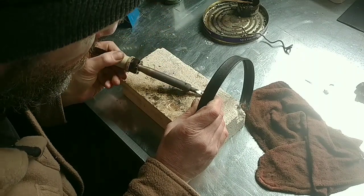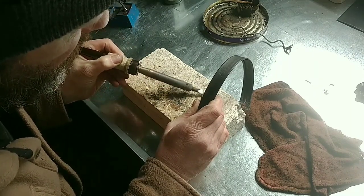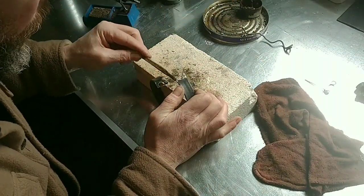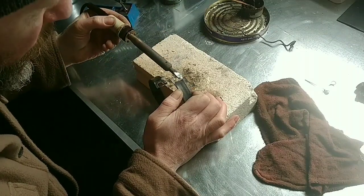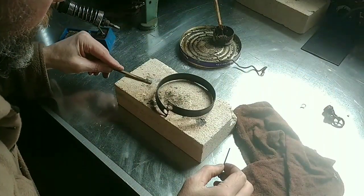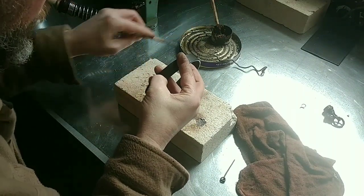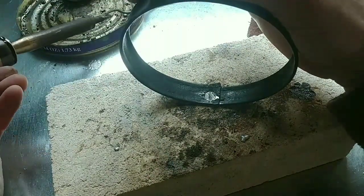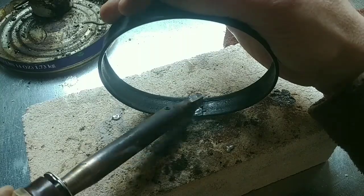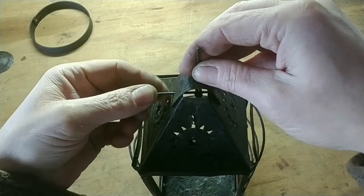When they put that electric lamp part in, whoever did that, they bored 2 large holes for that part to fit in the handle. And originally that handle would not have these 2 large holes. So what I'm doing now is tinning the surface of the ends of the handle. And I'm just preparing a thin piece of tin, which I'm going to put in between. And we'll solder that up. And then I'll punch a smaller hole in the center of that. And get everything assembled.